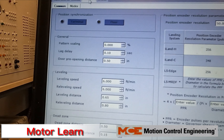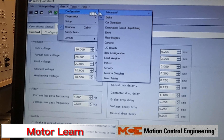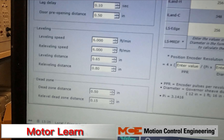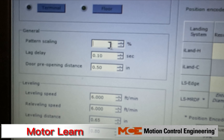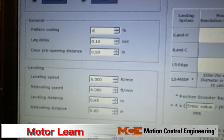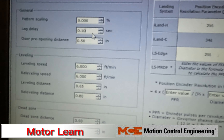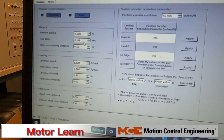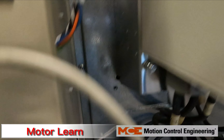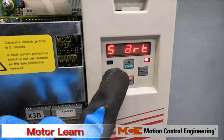We also don't want the sheave to spin, so go to View > Configuration > Pattern. Your pattern scaling is currently set to 100% — put that down to zero and click Send. After that's done, go back — your inspection switch is on and the drive is set to S-Learn — and then press Enter. It's going to say Start.